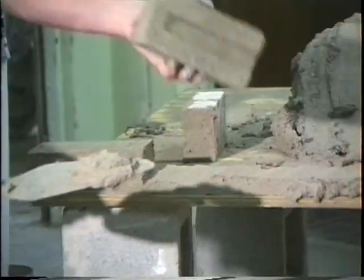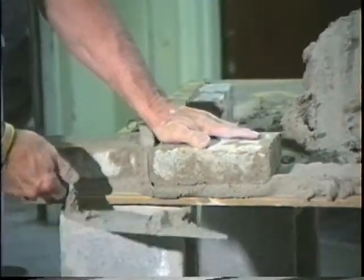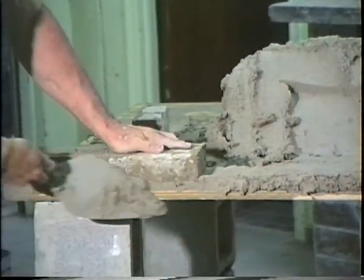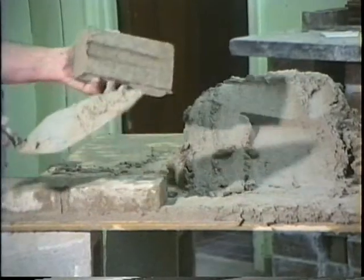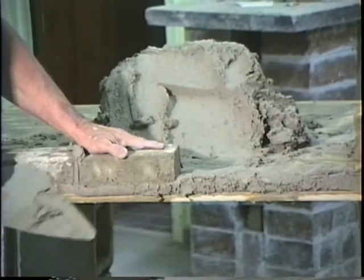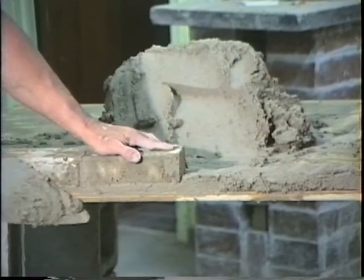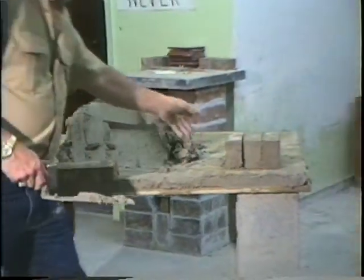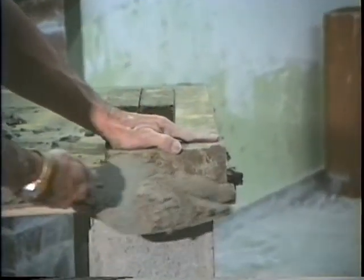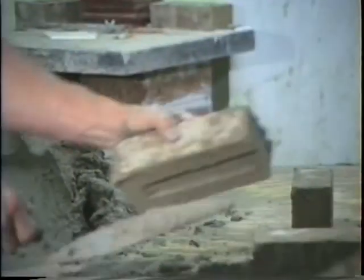Okay. The brick. I'm going to throw the heads on. Two bricks going this way. Cut that mud off. Use your eye. And lay the three. Three coming this way. Use your eye. Now come up here. It'll be about 3/8 of an inch off. Back this side, got your mud. Okay, now there, you're backing them in.